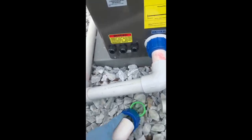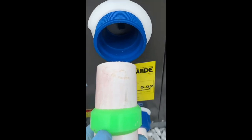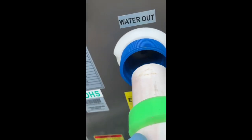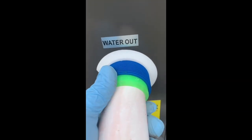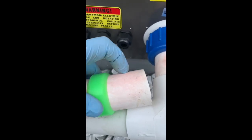Before we put the upper pipe connection, look in here — this is the flow sensor. We don't want to put any excessive pressure on that. There's a lip here and it shouldn't go further, but if you have an angular cut on the pipe it can rest on that. Be careful, do not push it all the way in to block the sensor, because it flips in and out to sense the water flow. Put the gasket on, slide it in, and the gasket stops. The distance here is roughly an inch and a half, which is plenty enough for it to grab onto.